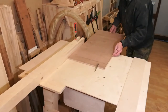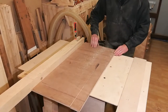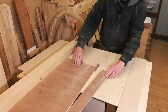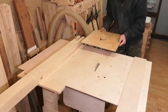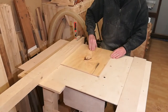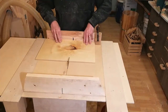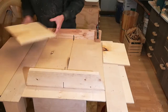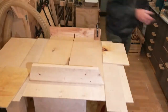The first measurement is that it can only be 35 centimeters tall, and I'm actually cutting it at 33 because I want to trim the top and bottom edge. I'll also cut the side panels to 33 centimeters, and since they only have to be about 22 centimeters deep I think I can get two out of each. I'll cut them at 22, leaving a centimeter for trim, and this time I will use a stop block because I need them to be quite accurate.